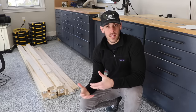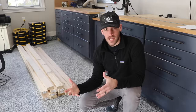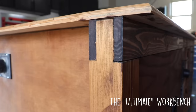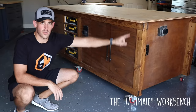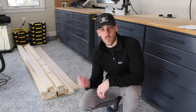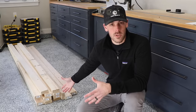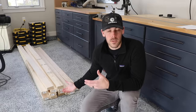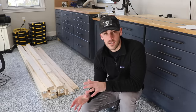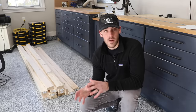I've personally found that a really good way to make shop furniture like big workbenches is to create a sort of frame and then build on top of that. In the case of the Ultimate Workbench, I used a combination of laminated 1x4s to create an exoskeleton. The concept I'm using here is very similar, except instead of 1x4 laminations, I'm going to use laminations of 2x4s. This makes things really approachable — anybody can do it. So the first thing we need to do is cut down our pieces to size, glue up our laminations, and then do a little bit of optional post-processing.